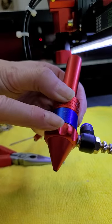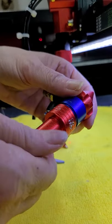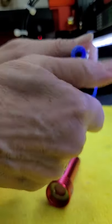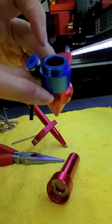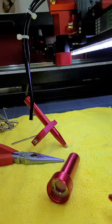For cleaning purposes, I would twist this red collar here so I could get down in there and clean everything. First I'm going to loosen this tube here — be very careful because there is your lens. When you're cleaning, you're going to want to take this off. If you don't tighten it up too tightly, you can get it off. You want to clean inside here so that you can get all the soot that's built up and any debris, because that can affect how well your laser works.